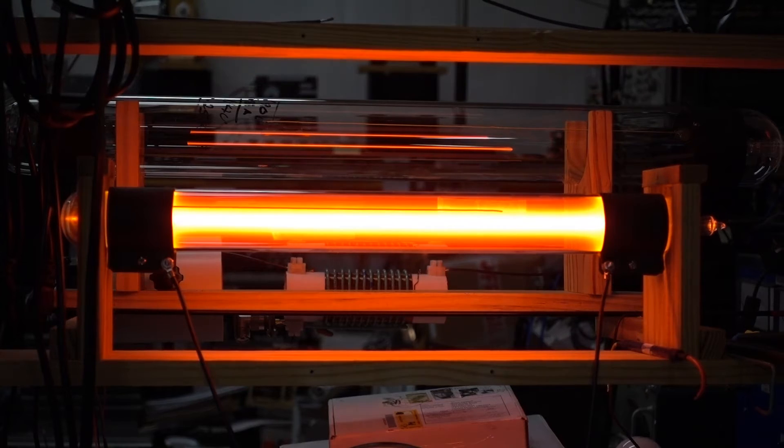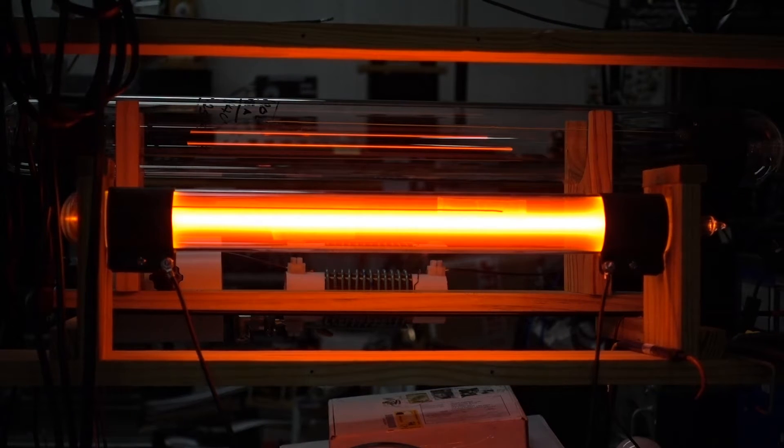This is 57 volts. Modulation frequency is 5 kHz. The tube appears to be operating nicely. At this point we are drawing a little less than 0.9 amperes.